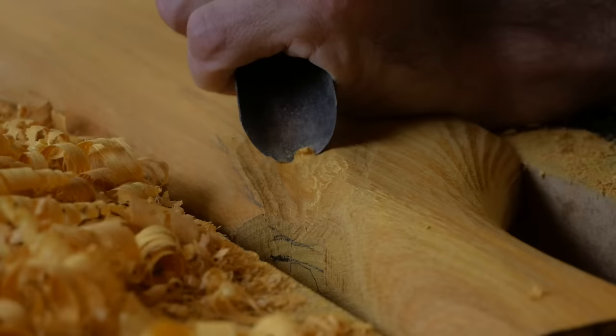A little sandpaper — I do sand at the end. You've got to get the tool marks out, but you want to be careful not to ruin those transitions. This little pump-up sander is a great tool — there's actually air in that sanding bladder, it has a little give to it and will follow the profile. I think I have 120 or 220 on here. I can sand off all the tool marks and clear out any tear out. I also put the recoil pad on and sand it flush since it's a little bit bigger. Then a coat of shellac goes on — that's not the traditional finish for gun stocks, but I'm using de-waxed shellac because I want to get right into checkering and it dries quickly. I can put oil over this after I checker, so I'll throw a couple coats of de-waxed shellac on.